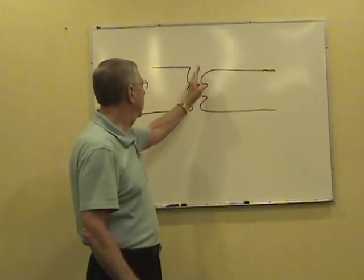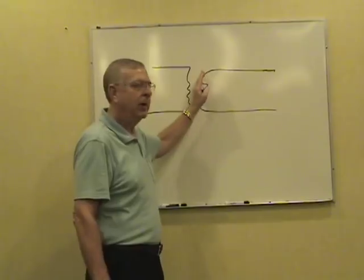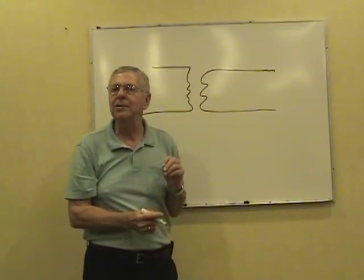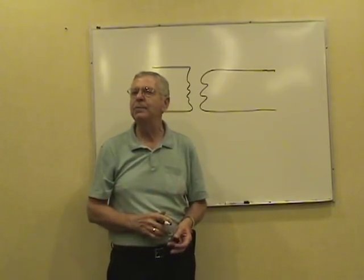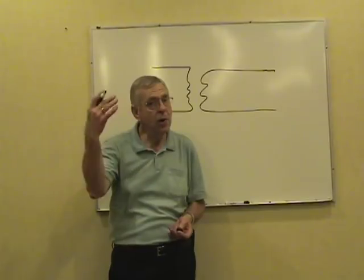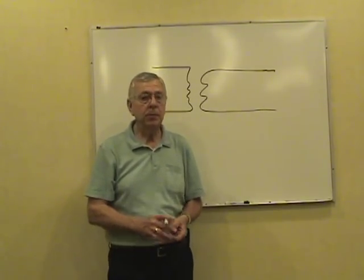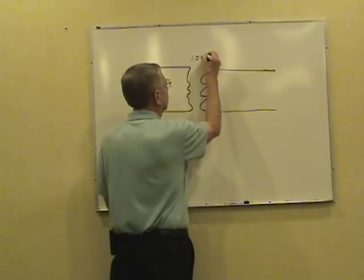You know, in reality now, there's a little copper core heat loss between the primary and secondary. You get rid of the heat, you still got a little bit of resistance in the windings here that you can't totally get rid of. So in reality, they're not an absolute 100%, but they're real, real high in efficiency. But assume, unless they tell you different, this thing's 100% efficient.